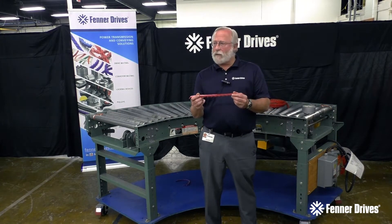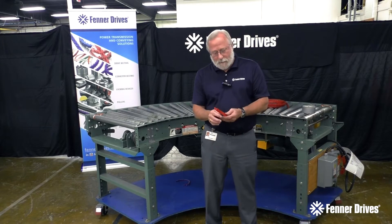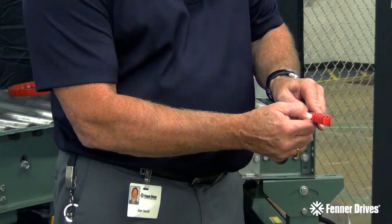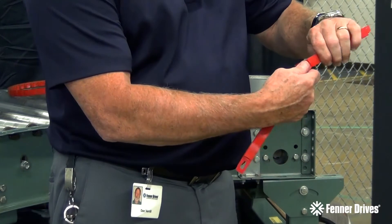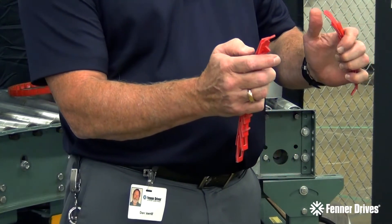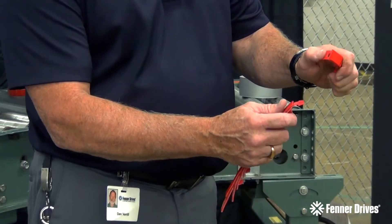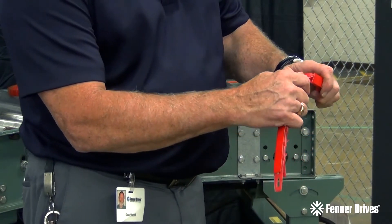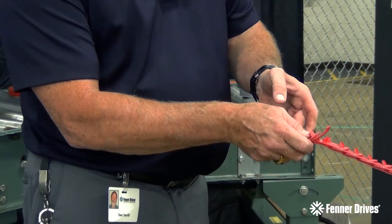The technique to take this apart is slightly different than the round belt. On the round belt, you turn the belt inside out, but this belt is easier to work from the inside. So if you look at the tab, I'm going to twist that tab and line it up with a hole. Now I can force it over the link. That allows me to twist the belt and pull the tab out. Very simple procedure. Going back together, I'm going to pull down on this link to clear the hole I've got to insert the tab into. I can insert that tab, hook this corner inside the link and push it through. I just twisted that tab and the belt came through.